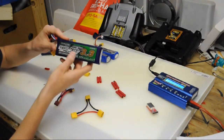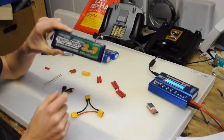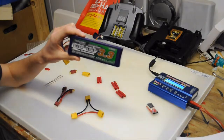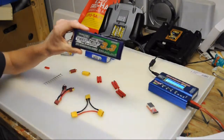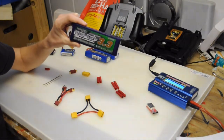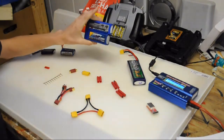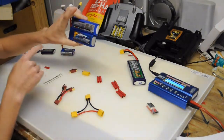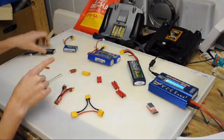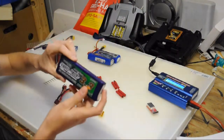This one is the Nanotech brand from Turnigy by Hobby King. Here you can see 3.3, which means it has 3300 milliamp hour capacity — if you pull 3.3 amps, you can do so for one hour. Here you also see a 2200 milliamp hour from Turnigy, and then a 500 milliamp hour and a 460 milliamp hour battery.